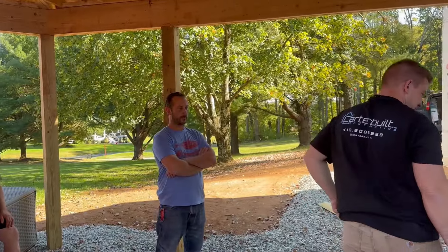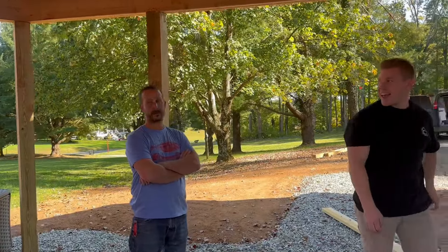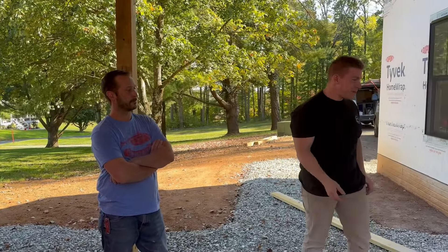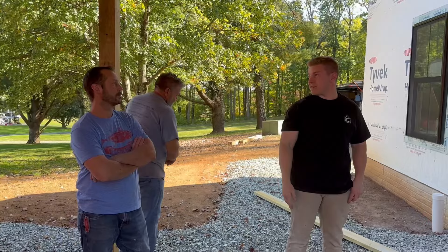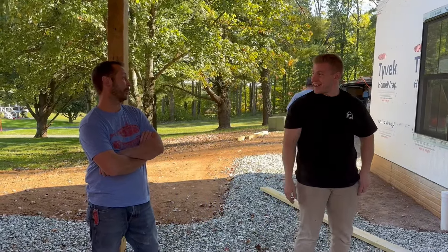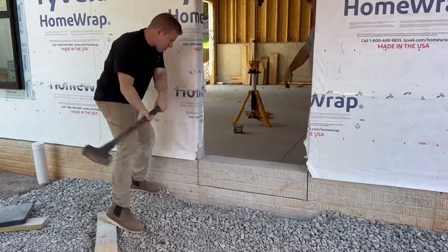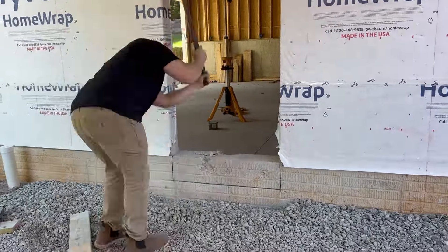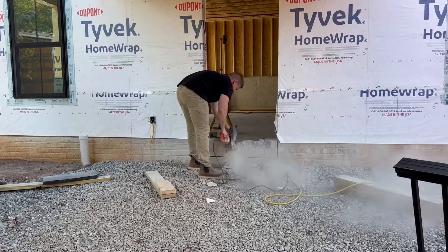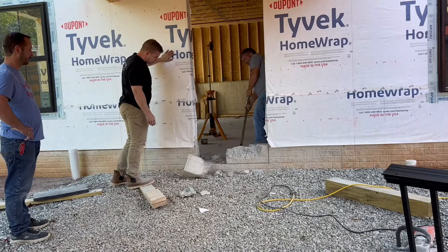Get as much as you can — beat it out, then grind. You can use a mini grinder or a bigger grinder, personal preference. Since cutting through the concrete did not go all the way through, hitting it with a sledgehammer was not easy, so we decided to cut a relief cut, and right after that the concrete came right out.